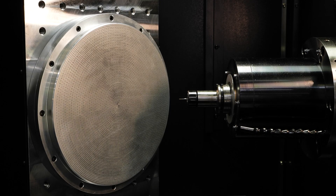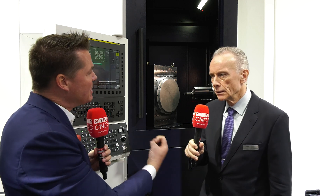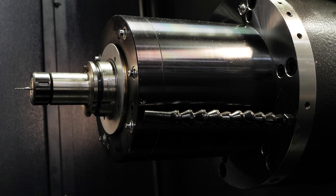If I'm not mistaken, correct me where I'm wrong Klaus, but we're talking seven millimeters deep, a millimeter in diameter — for my American friends, that's point zero three nine three seven, or forty thousandths — and we're doing this in about six point one seconds. You mentioned something very significant to me, and that's thermal expansion. We mentioned the number of holes, and although this looks like a lot, we have some with even more holes.